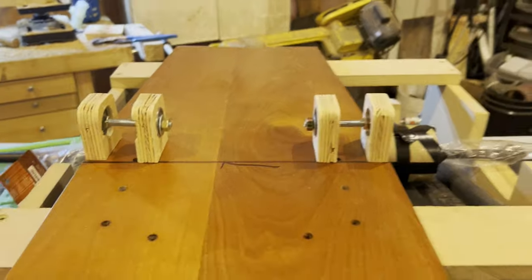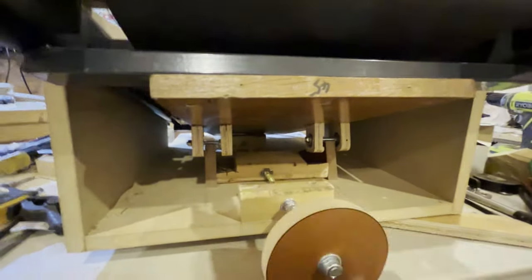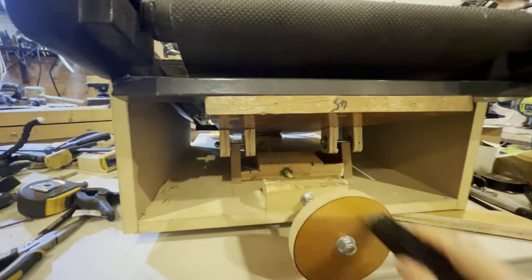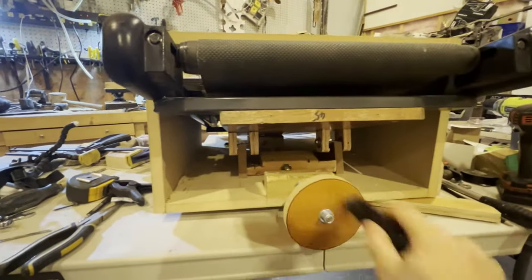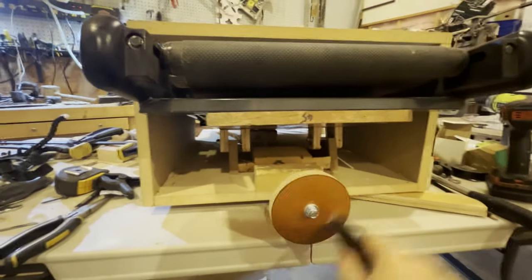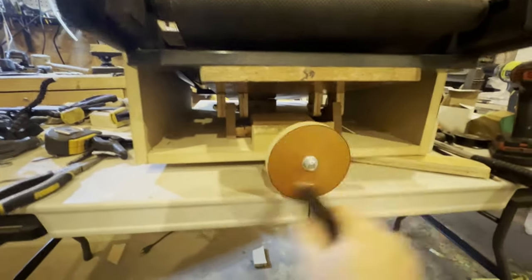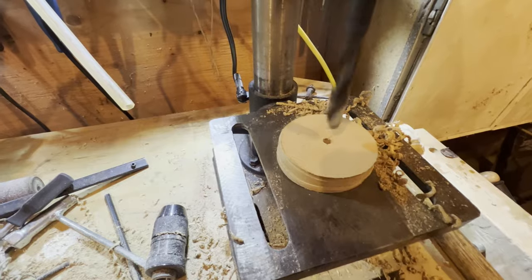Okay, I cut 4 equal blocks of wood. I put half inch rod between them, and I put bearings on each end, and then I nutted them at the end so that this ramp will actually roll up and down them. Now, this is awfully squeaky, and like I said, I end up changing it. I change out the blocks and how the hole was drilled through the 2x4.